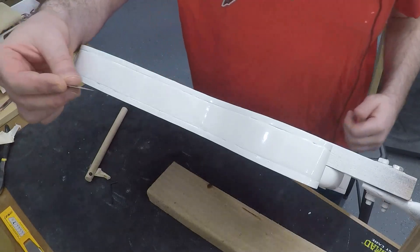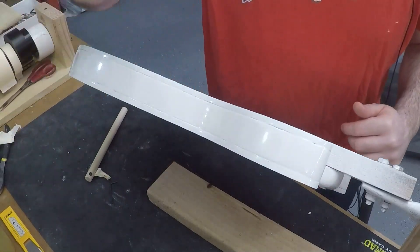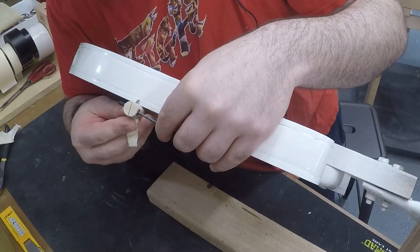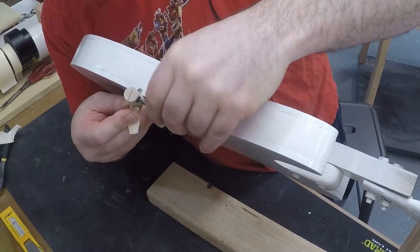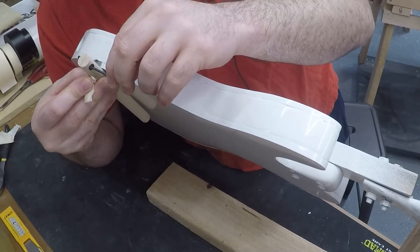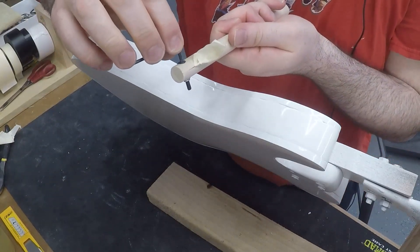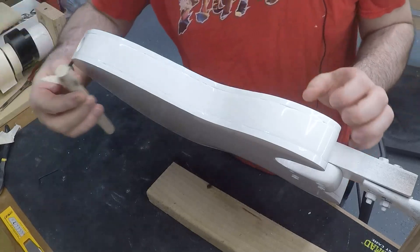What I've done is taken my razor blades — both tips get worn down, so you need a good sharp blade. I just snap it in half with a pair of pliers against a hard surface, making sure that my eyes are protected. Then I can take the broken blade and get it lined up so it's 90 degrees. A thumb screw would definitely be an improvement on this design. The blade is exactly as wide as the binding. I take the time to really lock this thing down, because you definitely don't want that to budge even the tiniest amount.